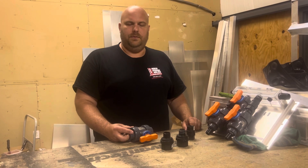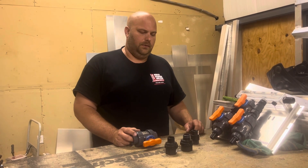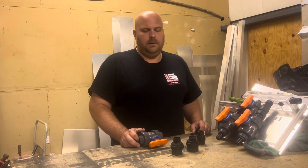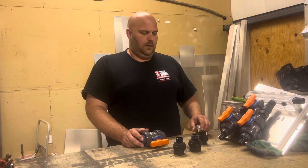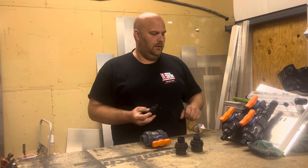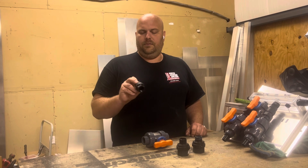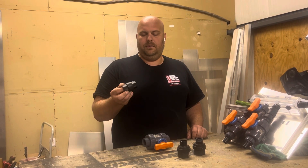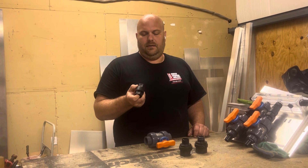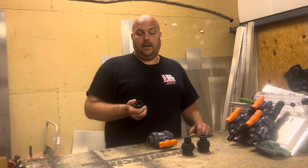There are quite a few check valve options out there, whether you are purchasing a mixer pre-built or building your own. This is a typical check valve used in basically everything that we sell or do out of here. This is a three-quarter inch check valve — it is a flap style valve, not a ball check style, and it does have a Hastelloy spring in it with a one-third PSI cracking pressure.